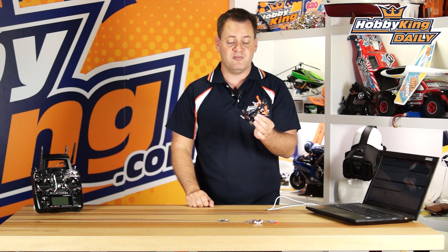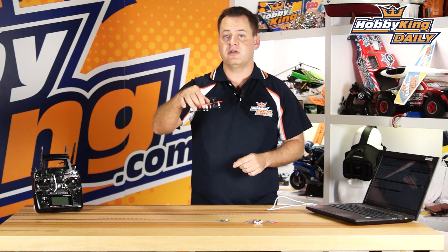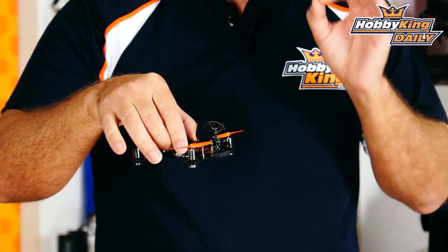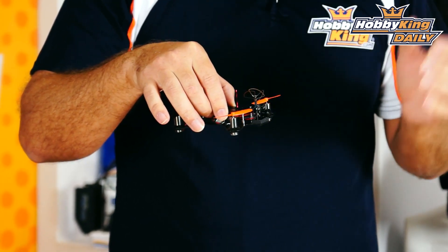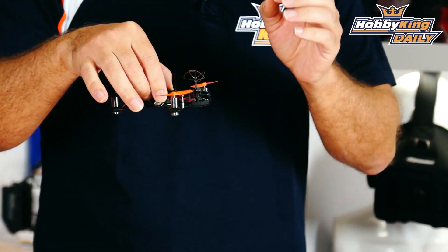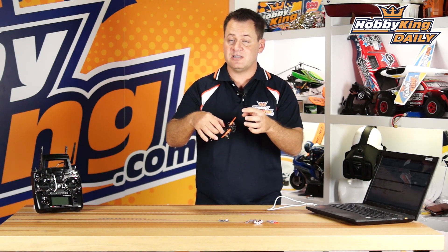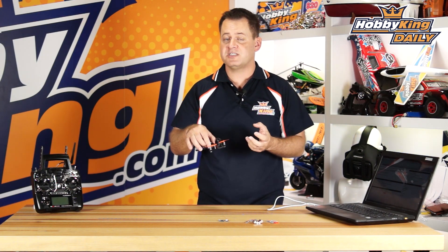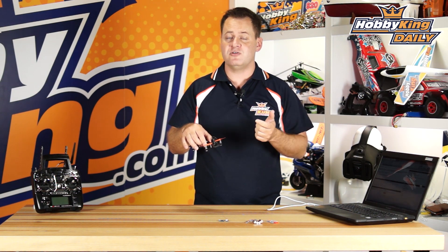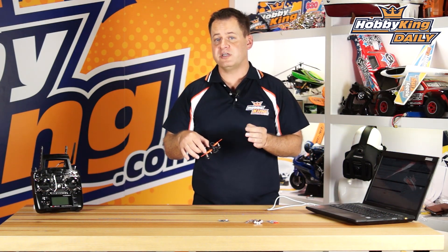So you can do your own FPV. There's some innovation in this particular frame — it actually comes with different adapters so you can use different FPV gear and different batteries. And there's real innovation right here on the front with the FPV cam. There are other cams on the market very similar to this one, but this is boasting huge specs by comparison at an unbelievable price. This is 600 TVL versus 480 TVL on anything else this small that's integrated. It's also full 25 milliwatts — anything else in this form factor all-in-one is normally about 9 milliwatts if you actually measure it — so we've got almost double the transmitting power with a much better camera.